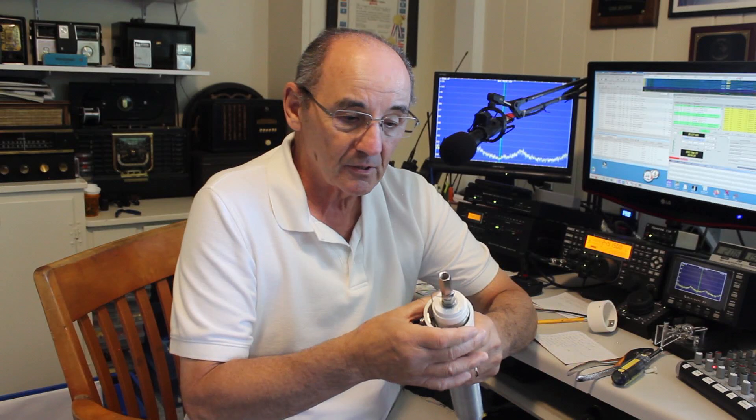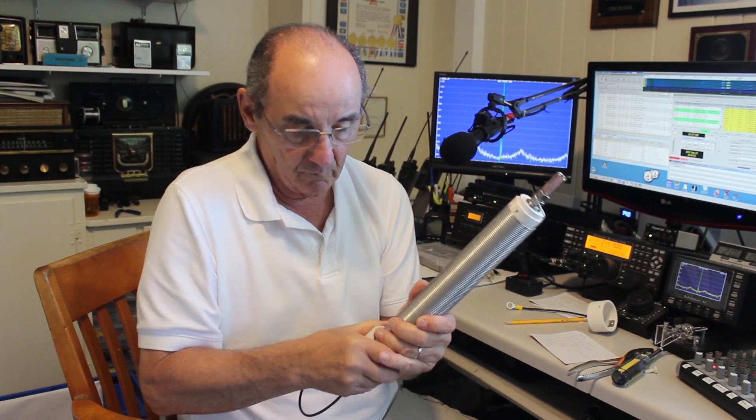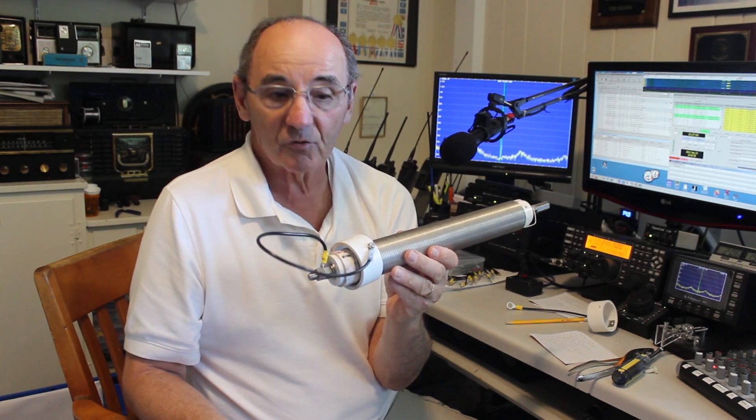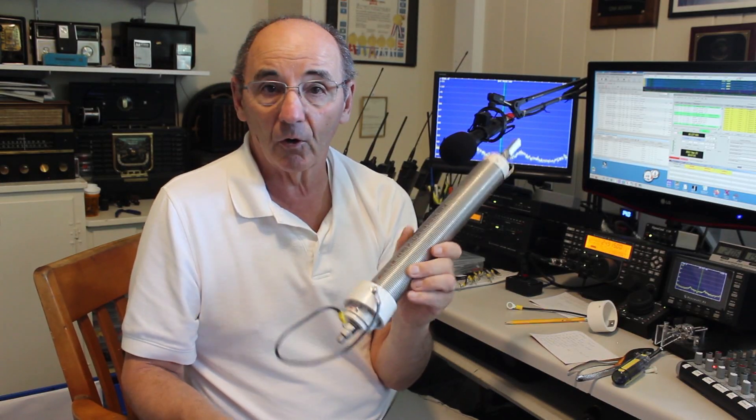So first thing I would do is check your coax. The second thing is ground radials. Ground radials need to be attached to the ground side of the mount. If it's our tripod, they go on the legs, and you need at least three 32-footers. If it doesn't tune, normally that'll take care of it. The best way to test it out: if you've got a 102-inch whip, put this on the very bottom rung — that's 3550 kHz. So if you've got a meter and you go to 3550 and have no continuity, it's something other than the coil.